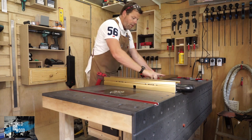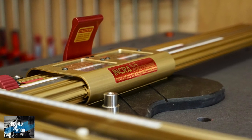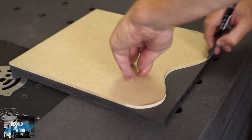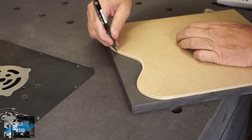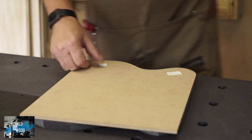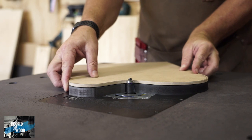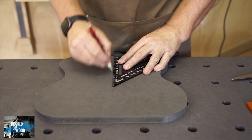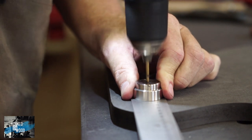A big advantage of my workbench is that I can attach the fence in under 20 seconds. For this we have to make a platform that we can connect to the workbench top, and on this platform we add the fence. I made this base with a curve, but there is no reason to do this — I just liked it. I drew this curve on a thin MDF piece I use as a template. By flipping it around I have it nicely mirrored. With the bandsaw I saw it roughly and finish it with my router table. To make the fence removable I use the dog holes, using my UJK system to add two holes, so I know they are on the exact same spot.